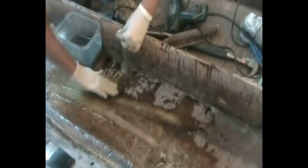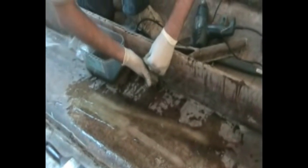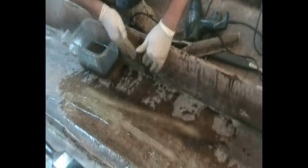I'll just get this nice long piece to extend right over the damage, and then down into the corner and up — see how nicely that went into the radius down the bottom. It's all nice and wet, which is how we like it. I'll just smooth it out a bit so it's all nice and bedded in. That's a nice strengthening support there — when that dries, you're not going to get a lot of flex there.